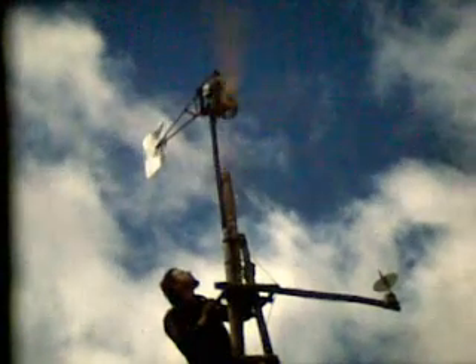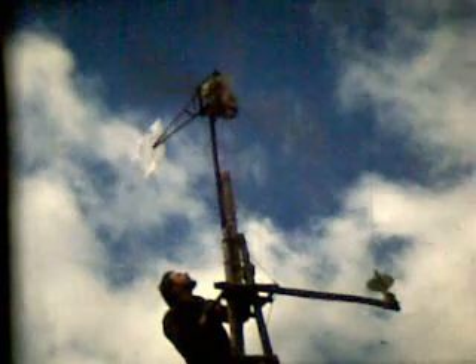This is 15 to 25 miles per hour wind speed. There on the lower right you can see the omnidirectional wind speed pressure sensor. One terminal is on the central wire, the other terminal is a copper ring around the wire. It doesn't matter which direction the wind comes from — the two discs at 90 degrees to each other will be blown downwind and the circuit is completed, energising the exciter circuit when there's enough wind to ideally produce electricity.